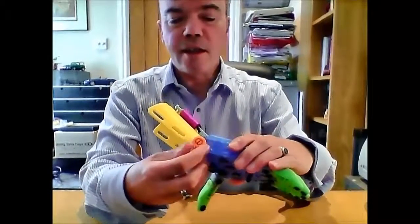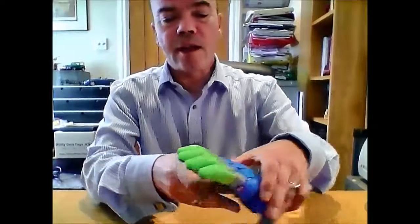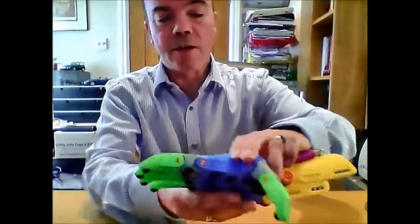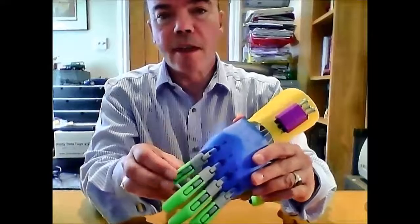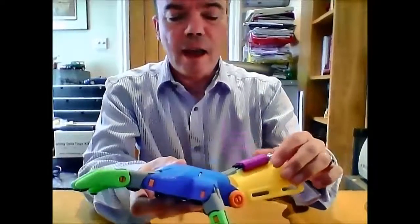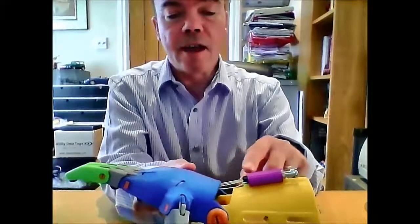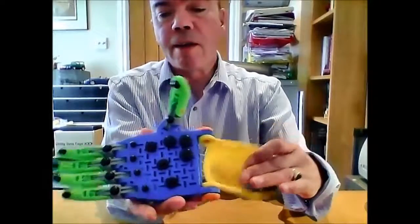As you can see the pins all move freely but they won't come off — they're rigid. The same with the fingers; the pins fitted really nicely and went all the way through and don't come back out again. The hand is sprung with dental bands, which give just about the right tension. The hand is strung using fly fishing backing line, which is a braided nylon line rated to about 40 pounds.